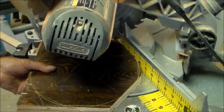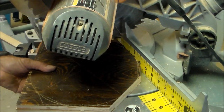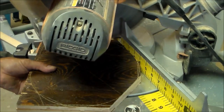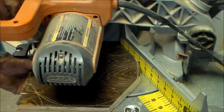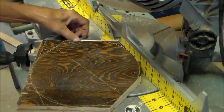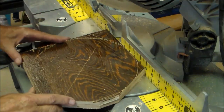Once I go around the perimeter this way, I'll have made six cuts. My next cut is going to be a reference cut like I did the first time, then from that I'll go around and hit every other one, and that will give me the 12 flat surfaces I'm trying to achieve.